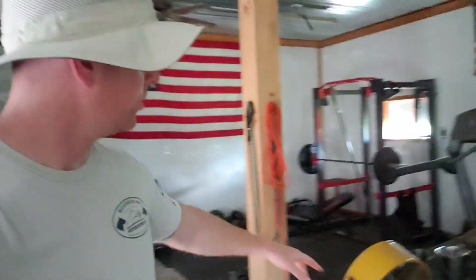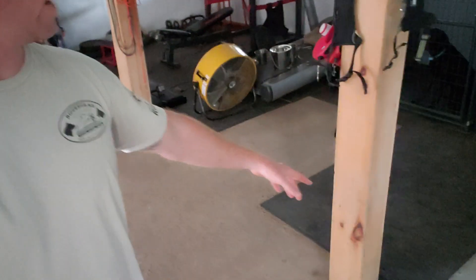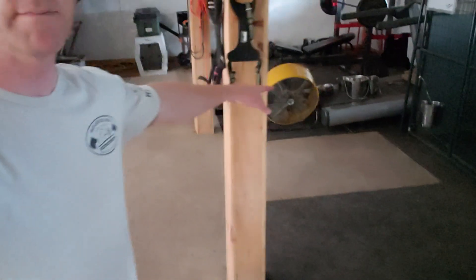One of the tricks I use is this commercial floor fan — looks simple and it is. By design I have kept the floor of my kennel for the most part all concrete. I have not matted out the whole thing; I only have mats where I need them, basically under kennels and in my workout area. The reason for that concrete is thermal mass — concrete can act like a thermal mass, meaning if I keep it shady in here with no sunlight, the concrete cannot heat up. It maintains the ground temperature, and by forcing air over the concrete towards the dogs it's almost like a free form of air conditioning — not as powerful as AC but it does a hell of a job keeping it cool.